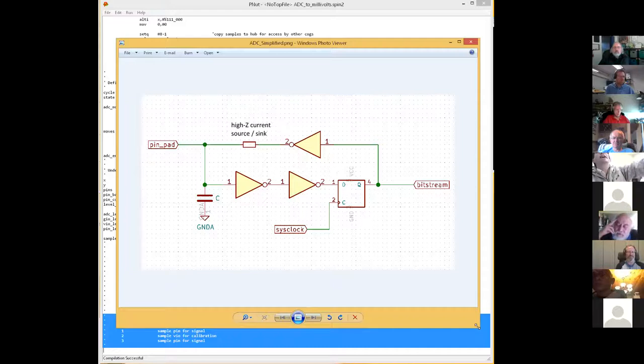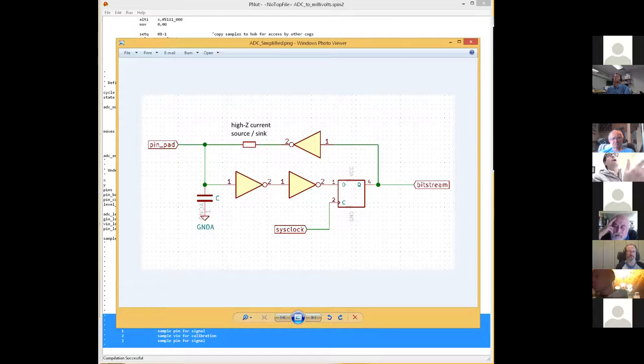Whenever we configure any kind of pin, we can do up to 32 pins at once using the add_pins operator. The P2's ADC has caps to ground and caps to 3.3V inside the chip — an improvement over P1 where the capacitors were external. In the P2, there are no longer those long propagation delays of 12 nanoseconds; instead the propagation delay is like 1.5 or 2 nanoseconds. There's also an analog front end with a selectable resistor — 1x, 3.1x, 10x, 31x, and 100x modes, done logarithmically over six steps.